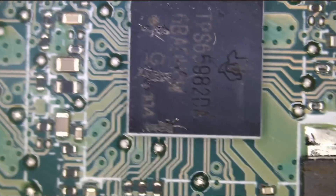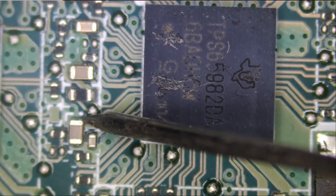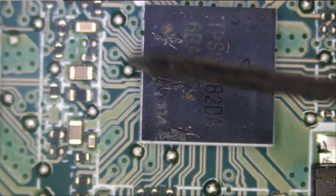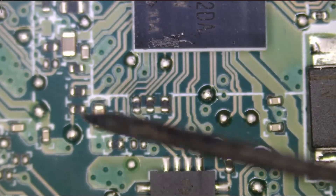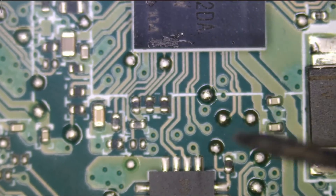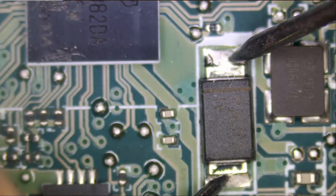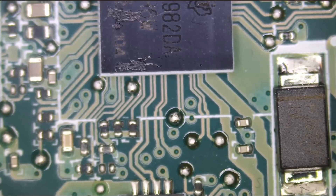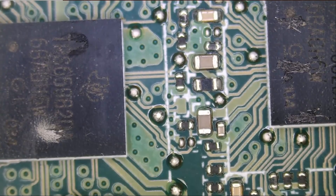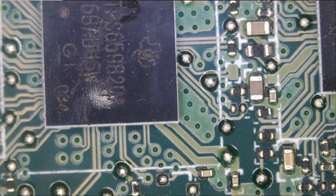Let me quickly measure around the chip to see if we have a short — meter in diode mode — and we're going to randomly test capacitors around this area. We do not have a short here. What about this one? None. And what about this diode here? The diode is testing good, so we do not have a short here. Even though we see a bulge on that chip, the bulge is not causing a short, but maybe rather it's causing an open circuit.